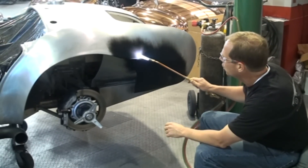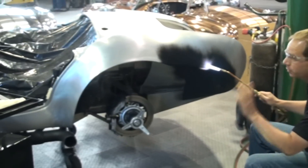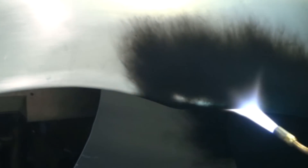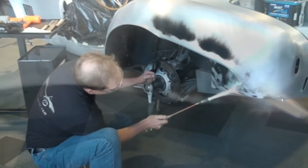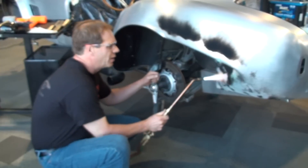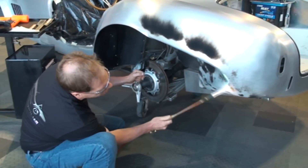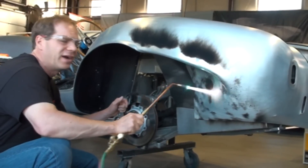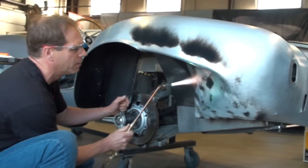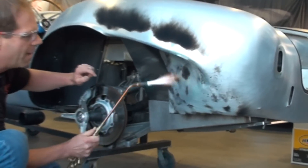The soot burns off at the exact temperature that the aluminum needs to be to anneal. When you do this you want to be very gradual — you don't heat it up in one place. If you heat it up in just one place you're very likely to melt the aluminum. If you punch a hole in the aluminum it's pretty tough to fix. So we're going to just really gradually heat up this wound. You can see the soot starting to burn off right there. We've burned most of the soot off — you don't have to burn every speck off; that's pretty dangerous. As soon as you've got most of the soot burned off you're pretty good to go. The aluminum anneal is at a very high temperature, right close to the melting point. You don't have much wiggle room, so just keep it moving. You'll notice this is slightly turning gold right there — that means it's as hot as I can get it.